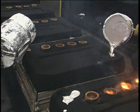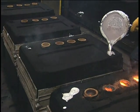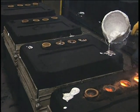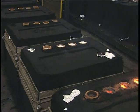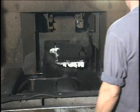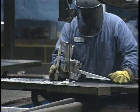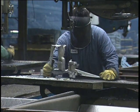After filling the mold, the metal enters the riser or risers, which serve as reservoirs of excess metal to compensate for metal shrinkage during solidification. Once cooled, the casting is removed from the mold, and the metal in the runners and risers is separated from the casting for re-melting.